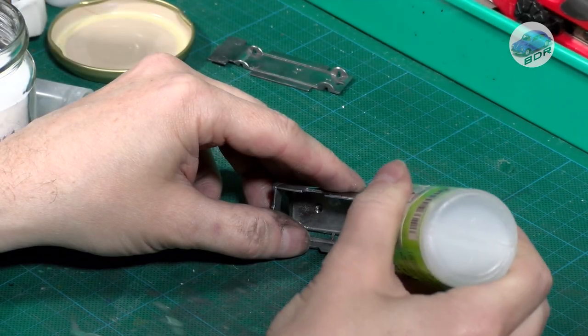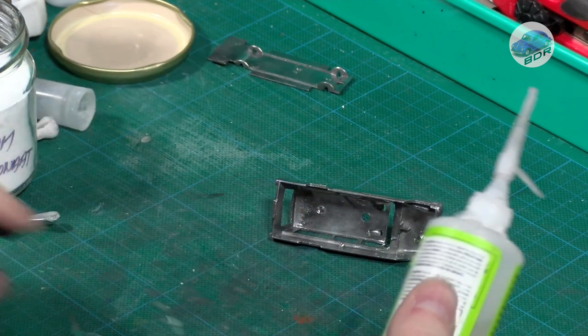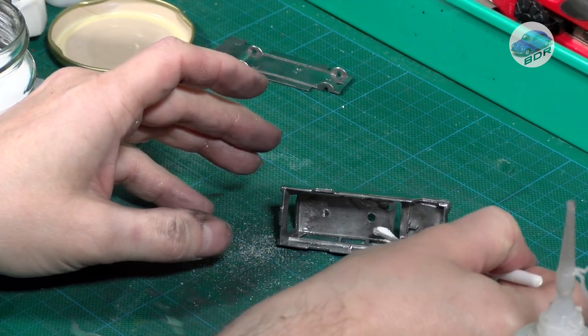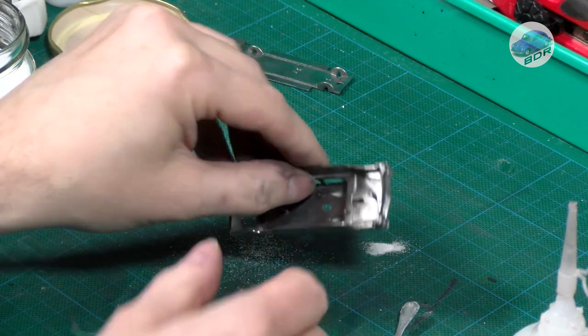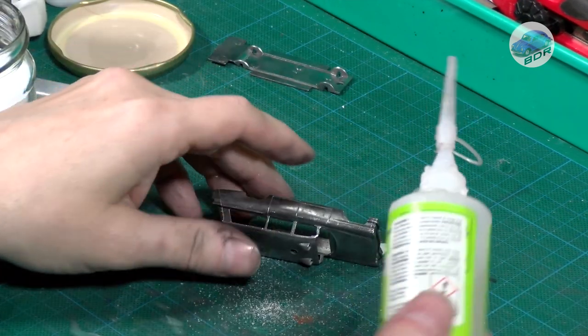With the paint removed and the body polished, we can have a good look at the casting for any damage. And sure enough, I notice a hairline crack in the left front pillar. It's almost invisible to the naked eye, but under a magnifying glass I can clearly see that it has cracked right through. This needs to be repaired before painting, as hairline breaks like this will move and end up cracking the paint and become a lot more visible than they were before.